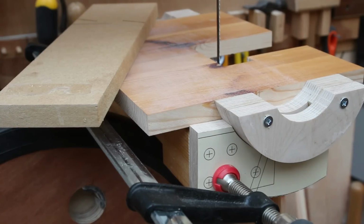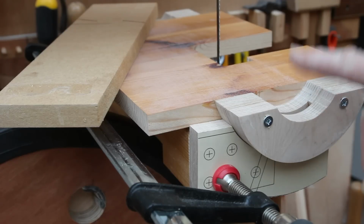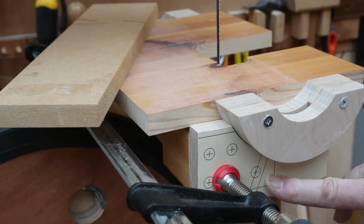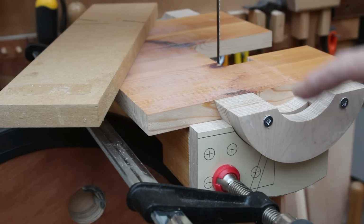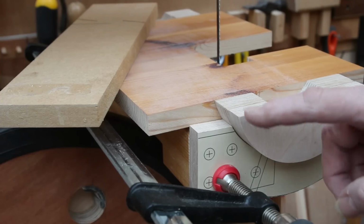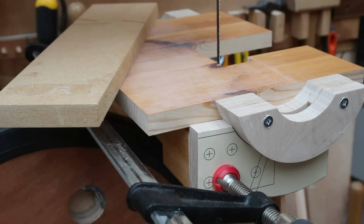I foresaw two main difficulties in cutting out the trunnions and the trunnion cradles. The first, my novice status at cutting out curves, and the second, the five dowels that the plans called for. I suspected that would strain my ability to line up dowel holes in opposing pieces past its limit. One of Matthias's suggestions was to cut the pieces of the sandwich, this 18mm, then the 6mm in the middle, then the other 18mm, out slightly oversize, glue them all up, and then trim them to the template all in one go. I felt, however, that that would run the risk of me ruining three pieces if I got it wrong, rather than just ruining one piece.